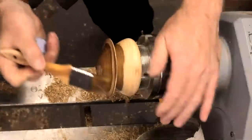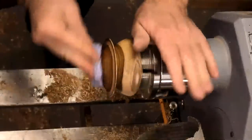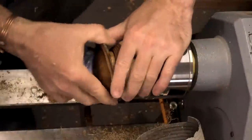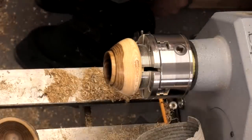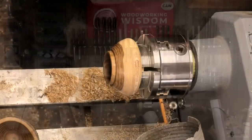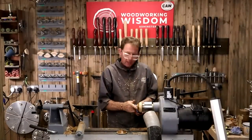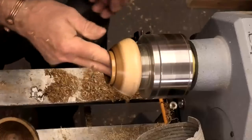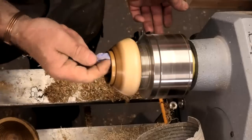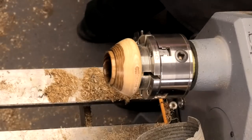We can seal the outside — the only reason for putting the lid on was so I don't have to hold it with my fingers. Wipe that off. Looks nice — beautiful color change. Bit of clean paper. Getting other questions occasionally — do you ever sand wet? If I'm using some exotics — cocobolo, ebony, or African blackwood — I might use water. You can wet sand with wax and even then get away with still using the cellulose sealer. The cellulose will cut through the wax layer — the wax can act as a lubricant to keep the dust down. That's not too bad. Done inside — nice.